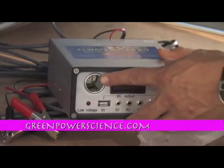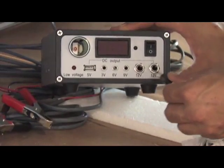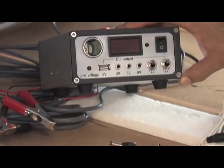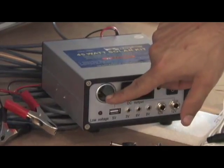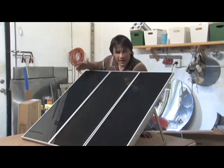On the front side of the controller you have a standard 12 volt lighter plug, and also compact fluorescent plugs — they're like speaker jacks, 12 volt. There's also a 3 volt, 6 volt, or 9 volt output option. One thing to make sure of is that you don't overload this socket — it has about a 5 amp fuse on it, so if you overload it it'll blow the fuse, but that's pretty easy to replace. The other outputs you can pretty much run as high as you want. That whole setup would normally take about 10 or 15 minutes. The frame's a little tricky but once you figure it out, it's really easy. You'll definitely want a very small flathead screwdriver — something you can remove computer screws with — for those rails on the back side.